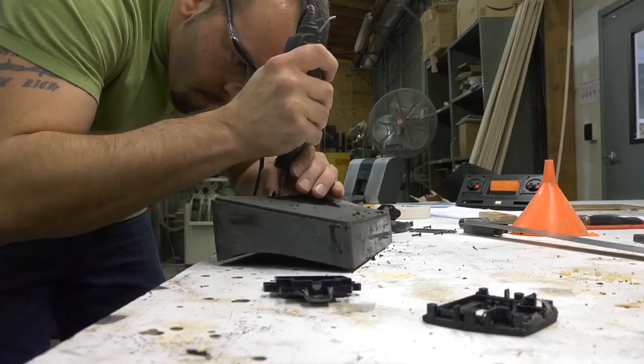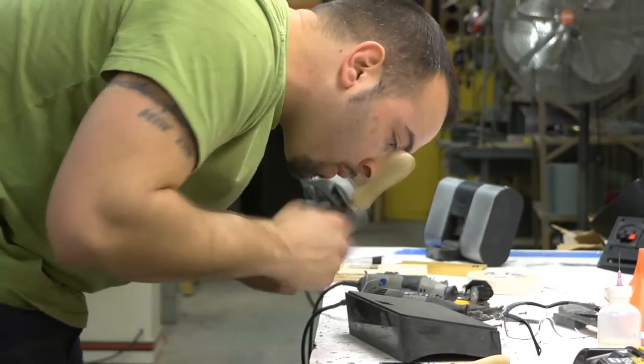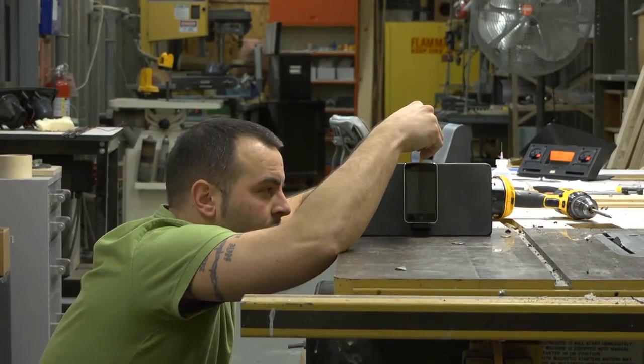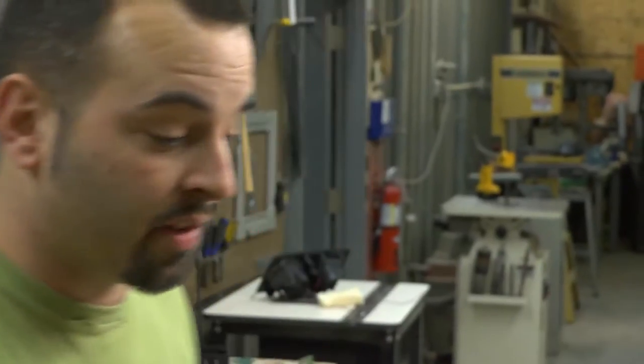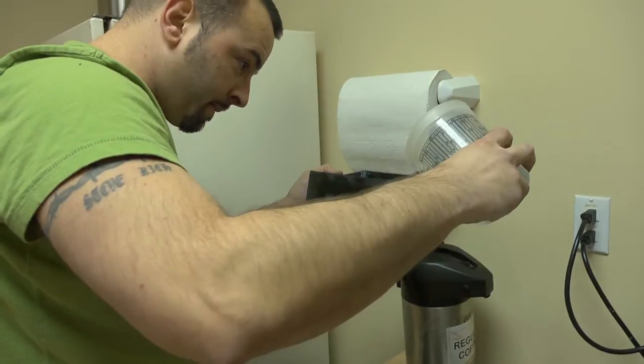Now I'm starting to build it, put the baffle together. I have to put the iPod dock in there. When I put the back on, the batteries, a fake PCBA board in there, and then I have to measure the box volume to make sure that I'm in the ballpark to get the performance that I actually need. So once this is airtight, I'm going to pour water in here to see how much water the volume holds. And then we can see if our prototype is good, or if it's bad, it's got to go in the garbage and we got to start over again tomorrow.